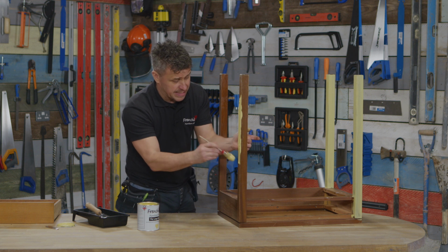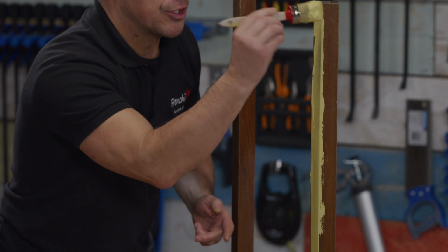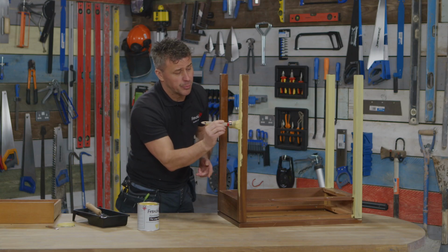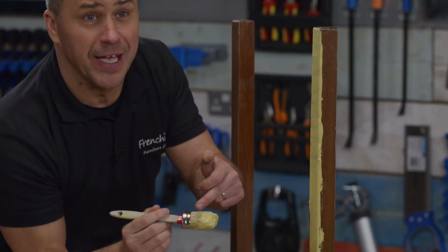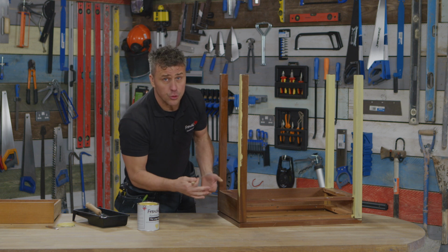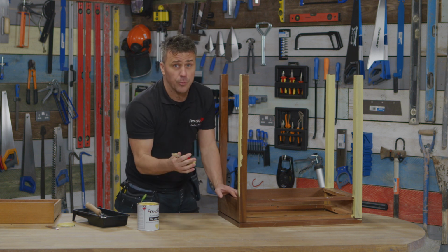Of course, it's a leg sticking up and down, so naturally you want to start painting up and down. You don't start painting these from left to right, because as you're doing that, you can probably see that side, the paint on there, the excess paint that you don't want, is now catching that lip on the corner and of course will drip down. You'll find yourself keep going around and around, it will become unenjoyable.